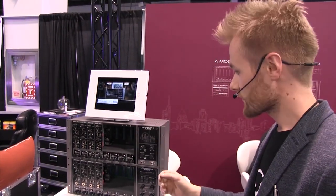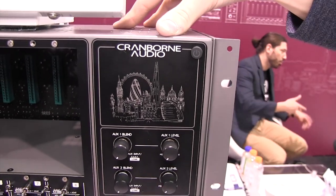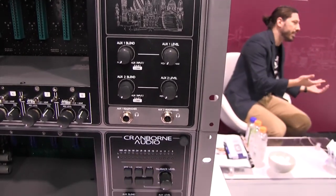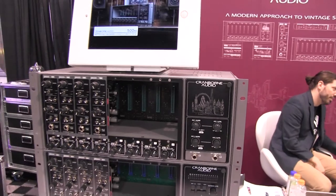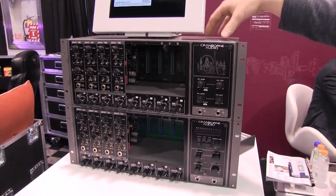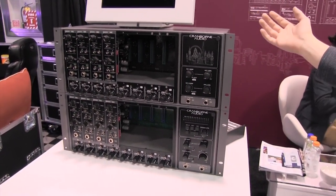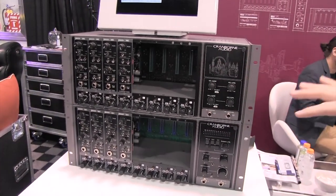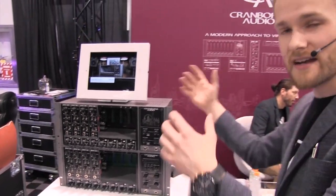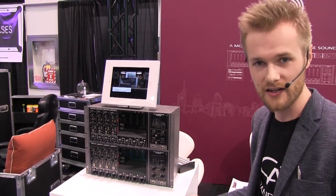So that's our preamp, but you can see here they're living in a rack as well. It's not like your average 500 series rack. We have two models here. This is the 500 ADAT and this is the 500 R8. The 500 ADAT is an eight-slot high current rack with a built-in summing mixer and built-in headphone amp section. It also has conversion built-in and ADAT ports on the back, so connect this up to your Universal Audio Apollo or any interface with ADAT and now you can get access to 500 series and record them straight into your DAW. You can also play back ADAT sources through each of your modules and re-record them back in, inserting modules via ADAT.